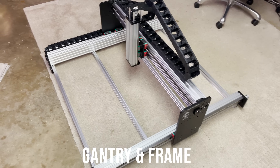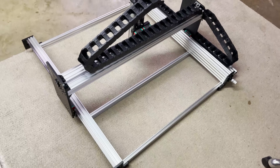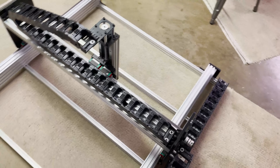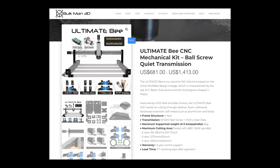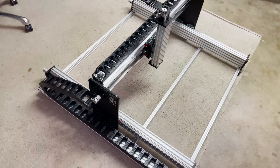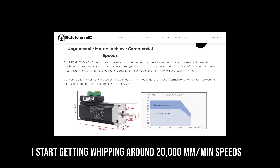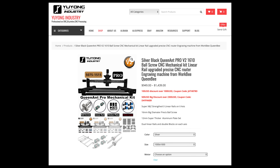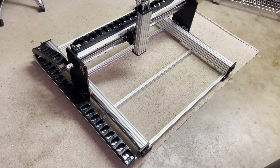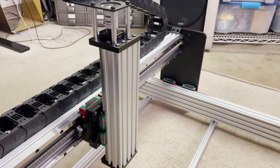In order to expedite this build, I decided to buy a gantry kit instead of building it from scratch. I figured it only cost me several hundred dollars more, but probably saved me a month's worth of work designing and milling out all the plates and sourcing all the hardware. I bought a Bulkman 3D Ultimate B kit, 1000x1000mm. I chose this kit because of the potential for increased speed with the 12x10 ball screws, which on their website they claim can achieve speeds of 30,000mm a minute using 3000rpm servo motors. To my disappointment, I found out that's simply not true — the ball screws start whipping before reaching those speeds. I've since learned of another kit called the Queen Ant Pro V2, which has 16x10 ball screws. If I had to build it again, I would probably choose that because they should achieve the same speeds but be less prone to whipping.